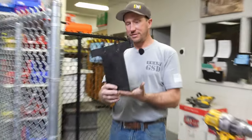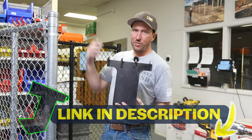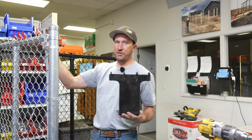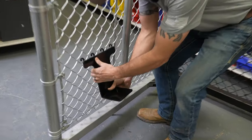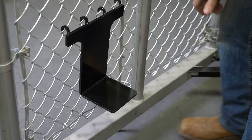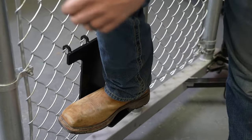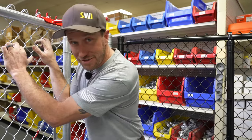So this is a foot dresser. Just like the top rail dresser, you have to have something to pull your fabric up. This is going to require your body weight to pull the fabric down. If your chain link has a hump and you're trying to pull that hump out, you put this on your chain link like that and step on it with your foot to pull that hump out. It's designed to use your weight so you don't have to cause extra pain in your fingers. Work smarter, not harder — using your body weight and gravity is working a lot smarter.